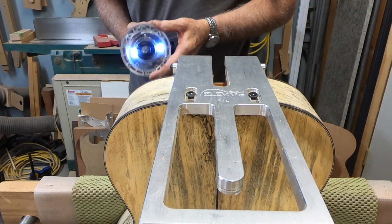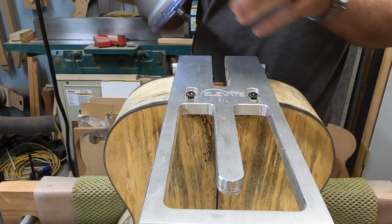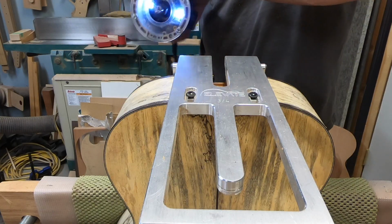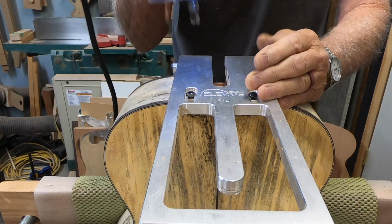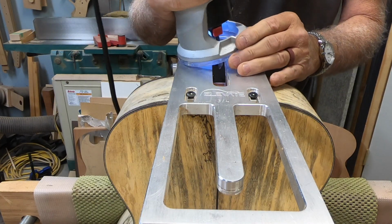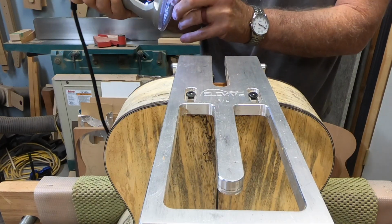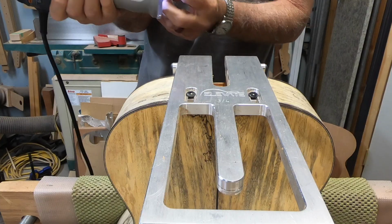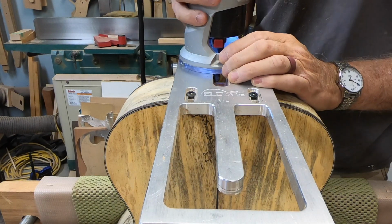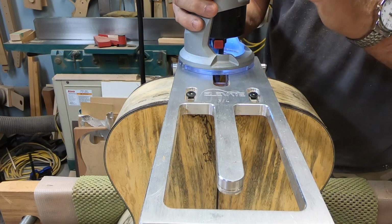Alright, so I'm going to have to extend my bit a bit to make this happen. Did I actually just say extend my bit a bit? You missed a perfectly good chance to use the word skosh. Now we'll just go in and take another lap around this thing, clean that up. My little bearing retainer is loose. Also double check that we have bearings in contact with the thing every time, because every time you adjust it, things move, right?